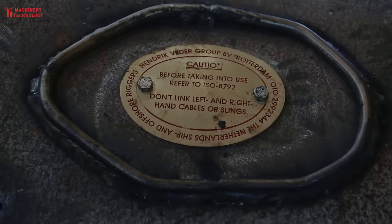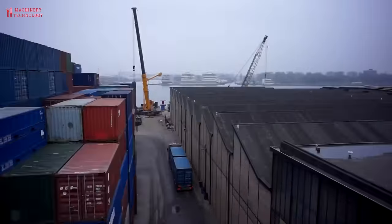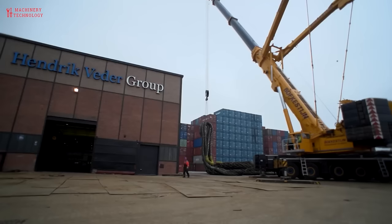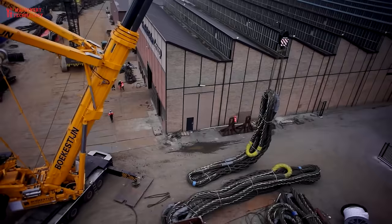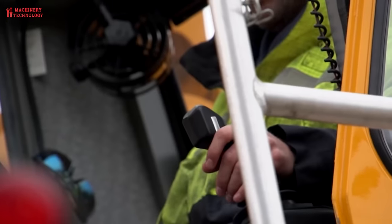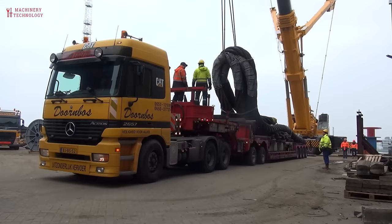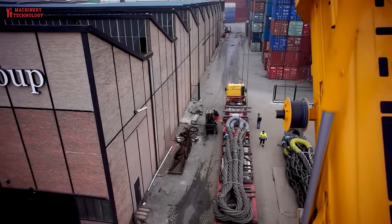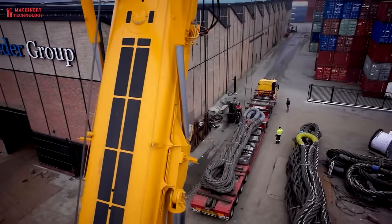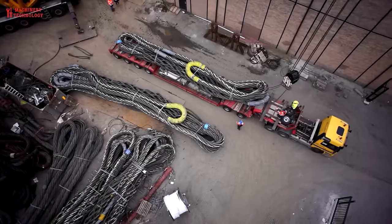Historically, wire rope evolved from wrought iron chains, which had a record of mechanical failure, while flaws in chain links or solid steel bars can lead to catastrophic failure. Flaws in the wires making up a steel cable are less critical as the other wires easily take up the load, while friction between the individual wires and strands causes wear over the life of the rope. It also helps to compensate for minor failures in the short run.